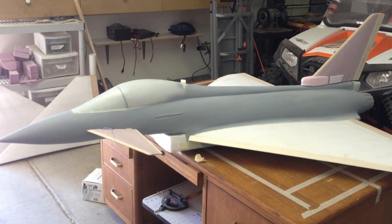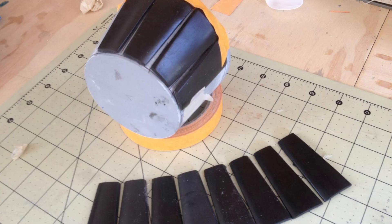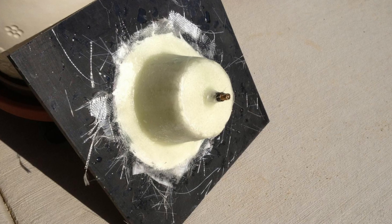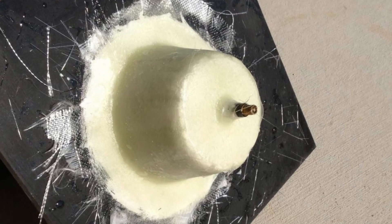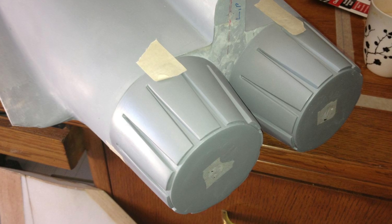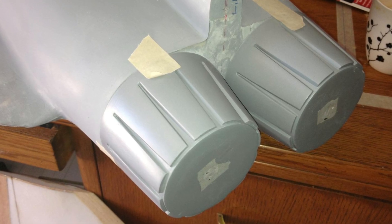At this stage it's time to start adding all the other parts of the aircraft. For the outlet cones I'm going to add a tire valve which will help release it, because this is a one-part deep mold — using 80 PSI I can simply pop the part out of the mold very easily. A simple test fit makes everything perfect.